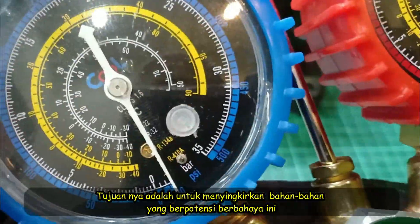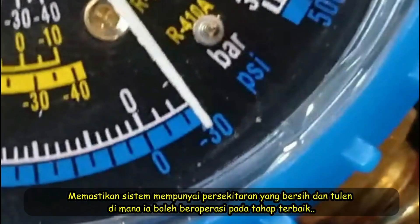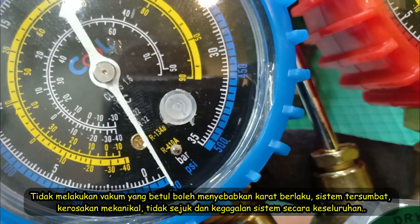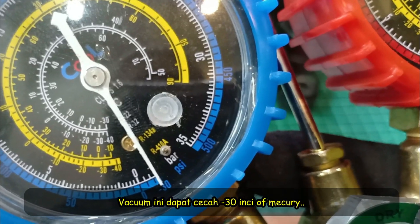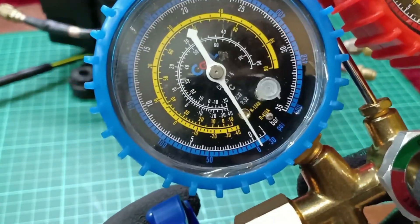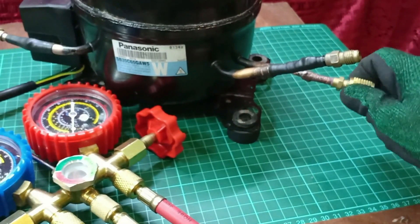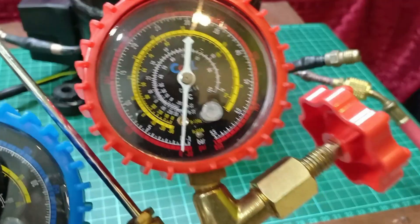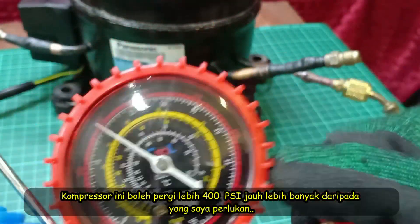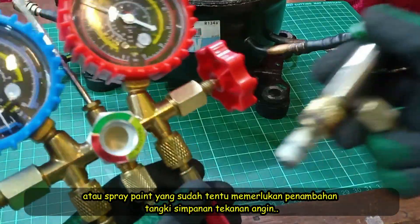The process of pulling vacuum is performed to rid the system of potentially harmful substances to ensure that the refrigerant has a clean, pure environment in which it can operate best. Not pulling a proper vacuum can lead to premature corrosion, line restrictions, mechanical breakdown, lower efficiency, and ultimate system failure. Looks good — it can vacuum almost 30 inches of mercury. This compressor can deliver over 400 PSI of air pressure, far more than needed for a pressure storage tank, well tank charge, or spray painting.